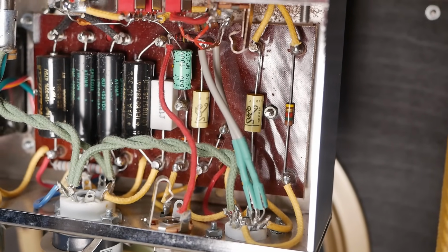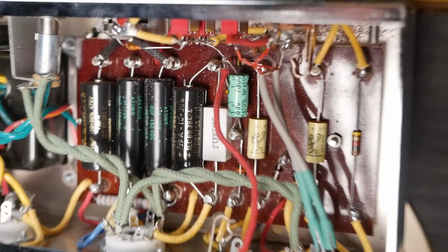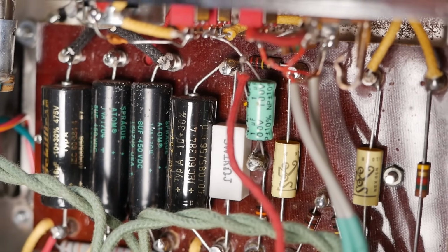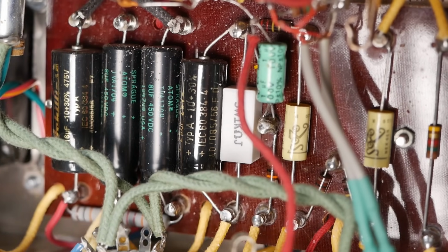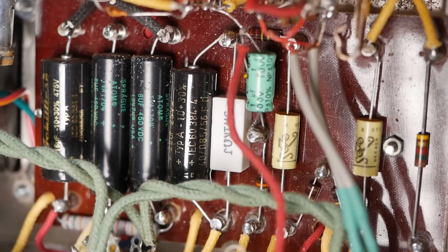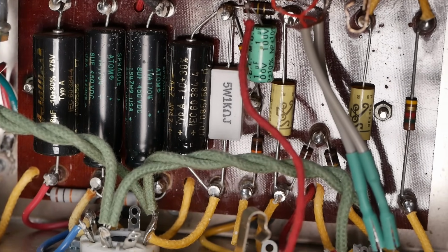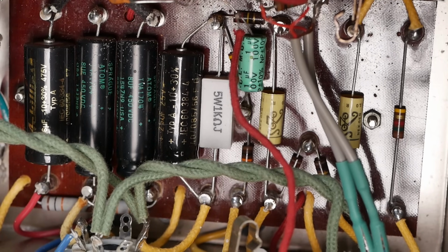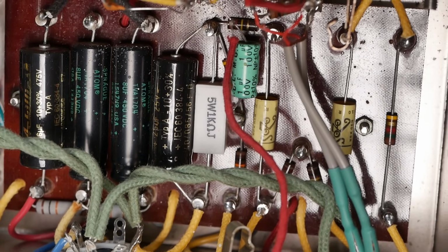You've got carbon composite resistors in the front end, a wire wound there, which is actually hugging the bypass cap. The bypass cap is ridiculously large for the value, it's only 25 microfarad, 25 volt. Normally, the ones I use are about 1/8 the size of that resistor next to it. The next thing that strikes me is that resistor's 1K. The standard value for this is 470, but I tend to like around the 560-ish mark, 680, depending on the valve, and depending on the mains input and the transformer. It's all a big fit together thing.